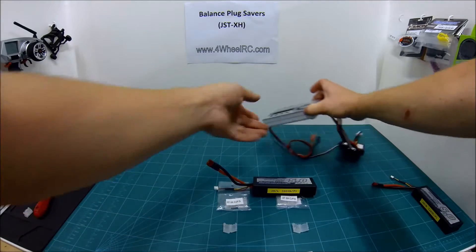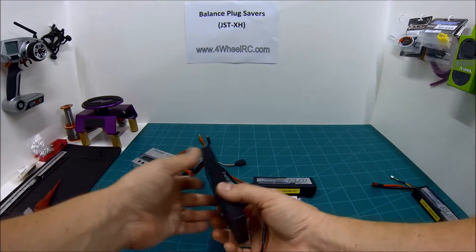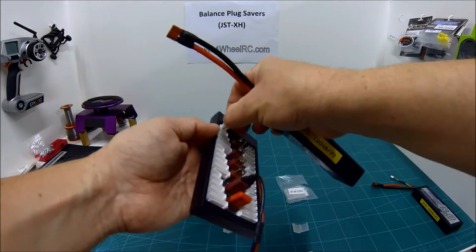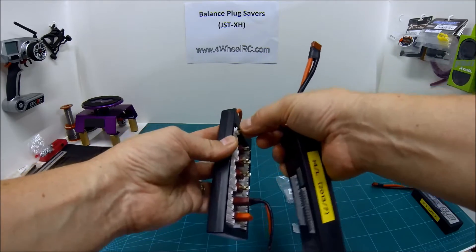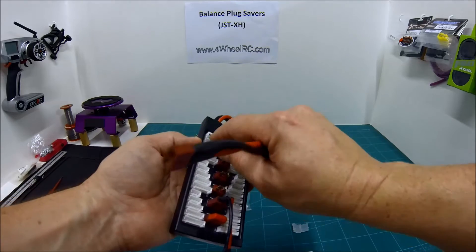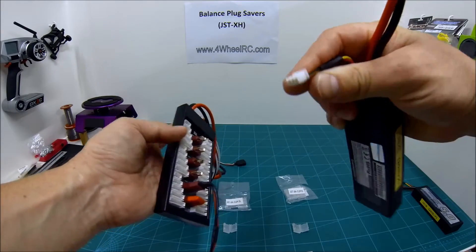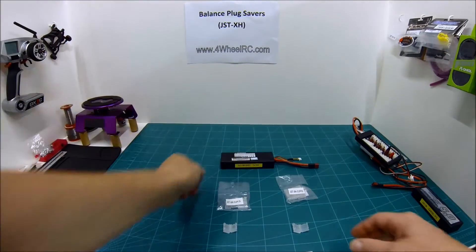This has got a little plug at the end that's quite small, and you might actually end up damaging it through general use. On your charger you're going to have a balance port, or in my case I use a parallel charging board so I can charge more than one set at once. When you plug these JST connectors in, they're quite stiff and you haven't got a lot of purchase to get hold of when you're pulling them out. Throughout months of in and out, you're probably going to pull on these wires a bit, weaken the plug, fatigue the wire, and the wire snaps out. These are a real pain to fix — a pain to fit a new one. So a clever little person has invented these things.